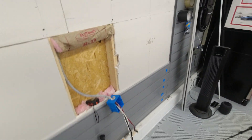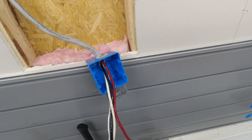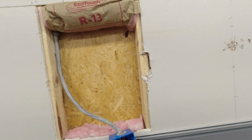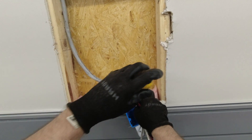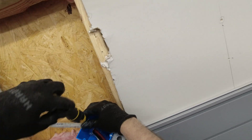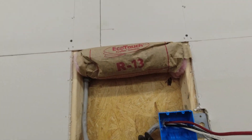This outlet will be on the center of the rear wall of the garage. First I had to remove some of the pro slat wall from this area. I'm doing this for two reasons: marking the location for the new HVAC wall unit as well as replacing this outlet. I then removed a section of the drywall where the outlet is located, cutting it along the studs so when I reinstall the piece it will fit back in nicely with good support. I also folded the insulation out of the way. This wire has the circuit breaker turned off in the electrical panel so I don't have to worry about shock hazards.